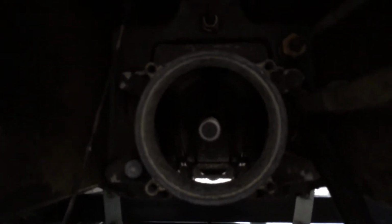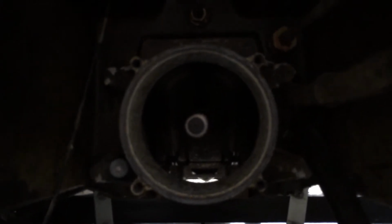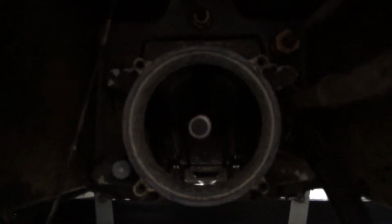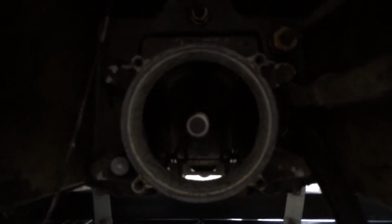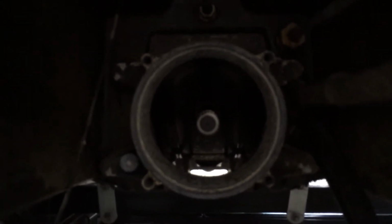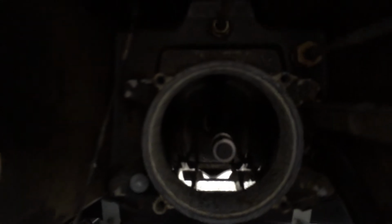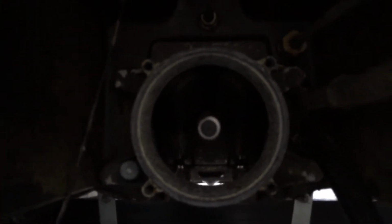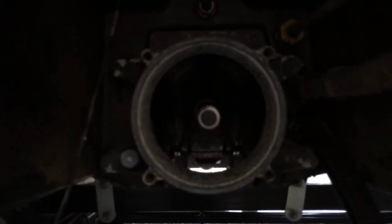So basically you're aligning the pump, or I'm sorry, you're aligning the engine with the pump, not the other way around. You can't align something that's fixed. So this is a fixed point, the engine is what is aligned to this. And again, the carrier assembly has nothing to do with it. The carrier assembly will follow whatever alignment is made between the engine and the pump housing here.